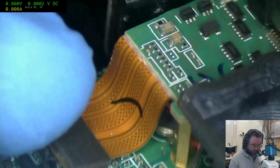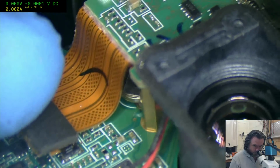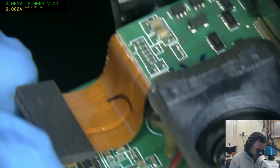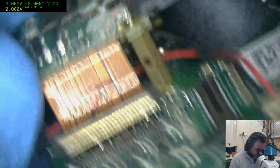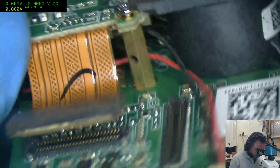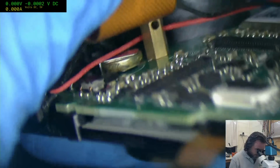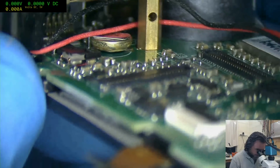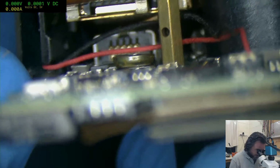Hey, Jason. Loosen the screw and unwind the post. Unfortunately, unwinding the post will tend to still apply the pressure on the circuit board. And then worse, it may have a... look at that. That's probably our culprit anyway. See how that battery is all busted up? That'll probably be why it's not charging.